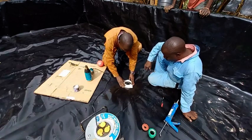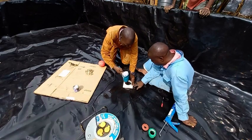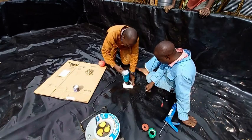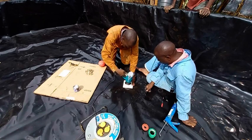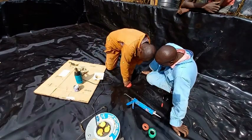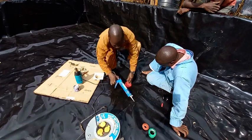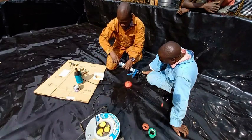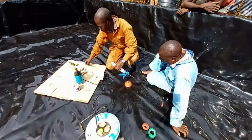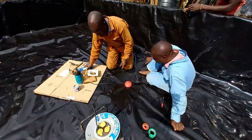After this stage, we will apply some heat on the part of the liner between the small hole and the edge of the outlet pipe below. Once the liner is soft enough, we quickly push in the plastic ball in order to widen it and push it towards the sides of the outlet. This ball should remain in place as the liner cools down. After the liner has cooled down, you remove the ball and apply silicone.